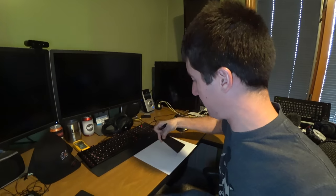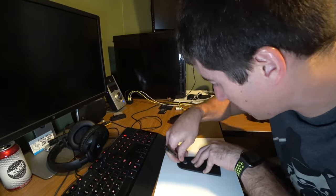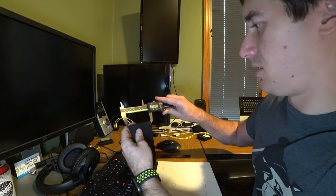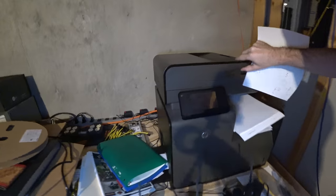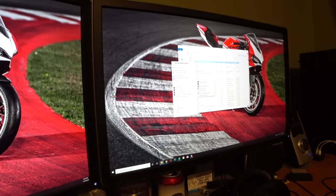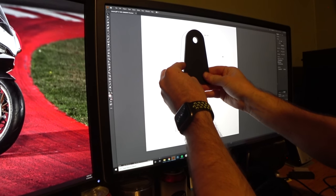This is how you make a bigger motor mount for your LS swap. Here's our measurement: 0.56. Plate, 0.2 inch. Our width at the widest point is 3. Width on center with the hole, 1.96. We bring our file into Illustrator, trace our artwork here, ungroup everything, and there is our cleaned up drawing.